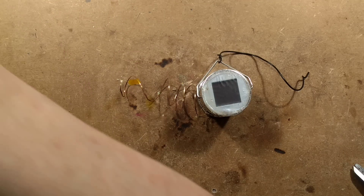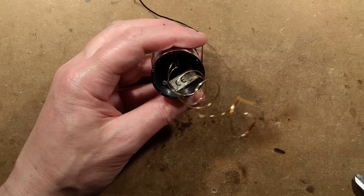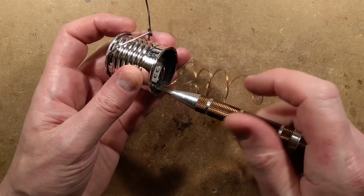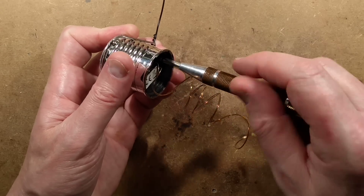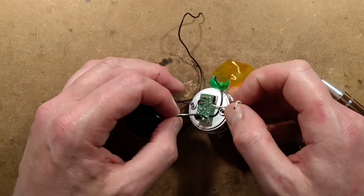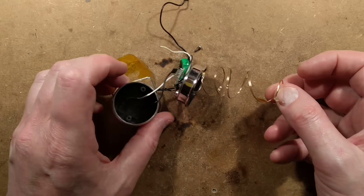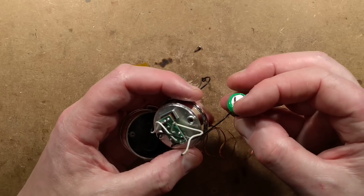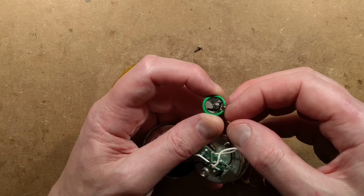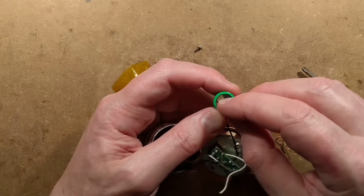Let's find out what went wrong with this one. I don't think it's corrosion, but we'll find out when I open it. This one is just not working completely. It could well be corrosion - if water has gotten from underneath the circuitry, it could just be a mess of corrosion. That's the curse of solar lights; they do tend to corrode quite badly. That wire off is probably something to do with it. Why has it come off the battery? That was a new battery I'd put in as well. The back of that battery has gone very black looking - is that just corrosion or some chemical leakage? It looks like something has perhaps seeped. The chemical from the battery would have come from this side, but maybe it's just seeped its way around and corroded the wire.